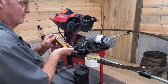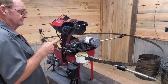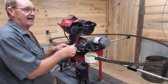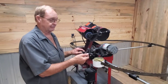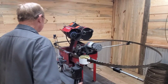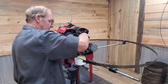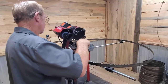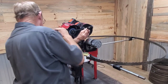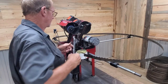One customer in Bogalusa has blades with one-inch tooth spacing. He also has 60 blades with three-quarter-two spacing, so he has to have the three-quarter cam to do those. Something really interesting about the Cook's system is the easy cam changeover and the fact that they stock a lot of different cams. People running these Cat Claw sharpener and setter systems are sharpening not only for themselves but often for many customers. This is literally a sharpener you'd use for a business.